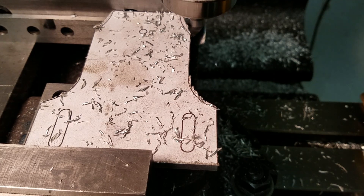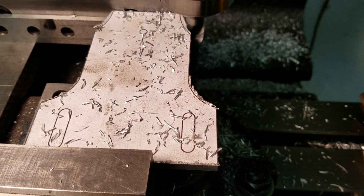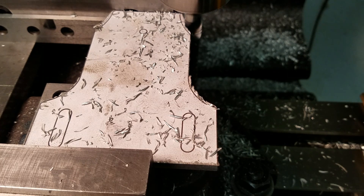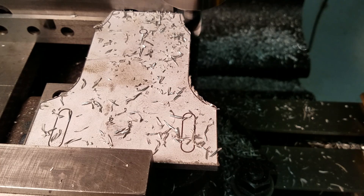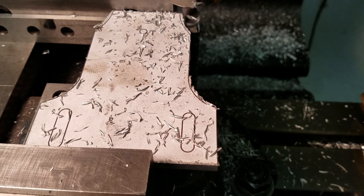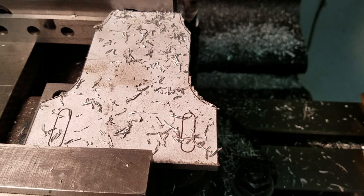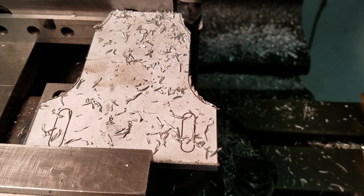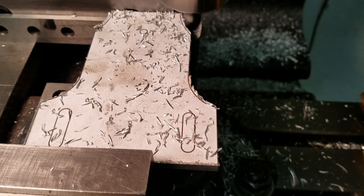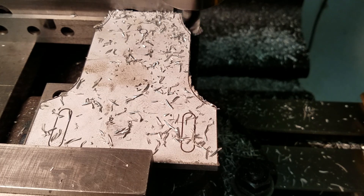So I did a little drawing that kind of reflects the shape of the y-axis end plates, printed it out, and I'm kind of coloring outside the lines — really is all I'm doing. It reminded me of things I've seen Darista do where he prints out patterns. I glued it down on the aluminum like he often does and cut it out. I thought about doing this on the router, but I've got a lot of experimenting to do with speeds and feeds to make the router really cut aluminum well. The best thing to do would have been to have this part be integral to the y-axis plate, in which case this whole part would have been a moot point.